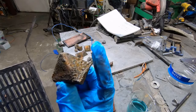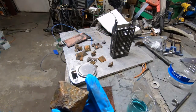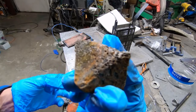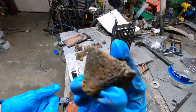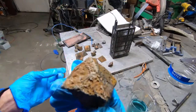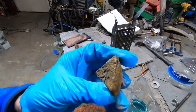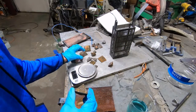There's just so much anode sludge in there that we need some type of cleaning action. Delicious the Blair mentioned the idea of vibrating the tanks to shake the material off, which may be better than my idea — which came from that suggestion — which was to use ultrasonic transducers in the bath to constantly blast off any residual. I believe that may cause excessive copper content in the anode sludge though, so we'd really have to be careful what power setting we used.